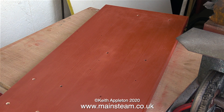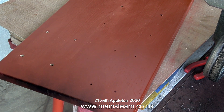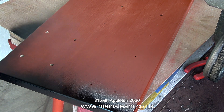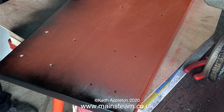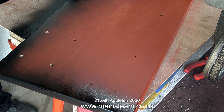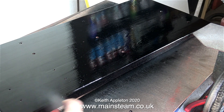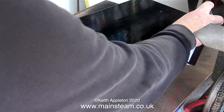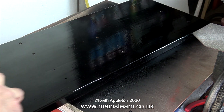Now it's time to go into the outer part of the workshop to work on the baseboard. I've drilled some of the mounting holes slightly larger because they were a bit tight on the original installation, and I've given the primer a rub down with wet-and-dry sandpaper. My choice of paint is HMG satin black, which is a spray-type enamel. It's really good stuff — it doesn't dry shiny at all, it's nearly matte but not quite. Obviously as I'm spraying it looks very shiny, which is what it would look like in gloss black — but no, satin black from HMG Paints is definitely the way to go.